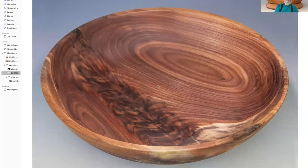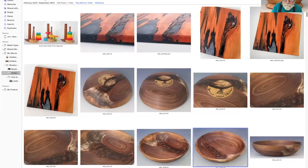anything. What I found on some of these things, besides the end grain, is the different densities of wood. So if you're hitting burl and then you're getting tear out shortly thereafter, that may be part of it. So I'd look at the feed rate of the tool. I agree with Mike too. I like to put on, I do a lot of walnut like this, and I usually use sanding sealer or mineral oil.